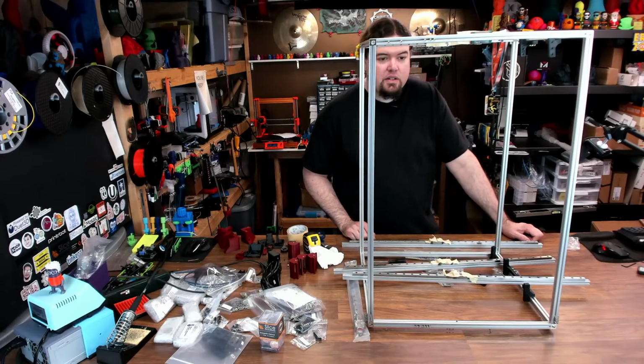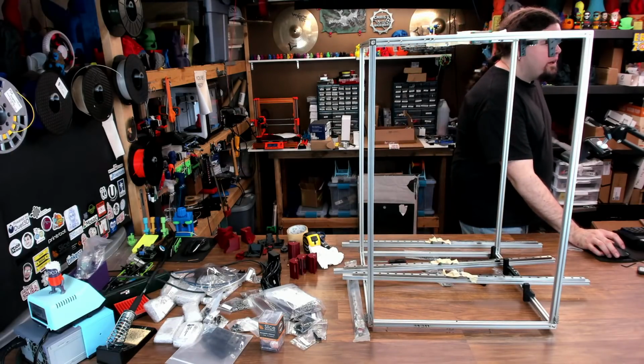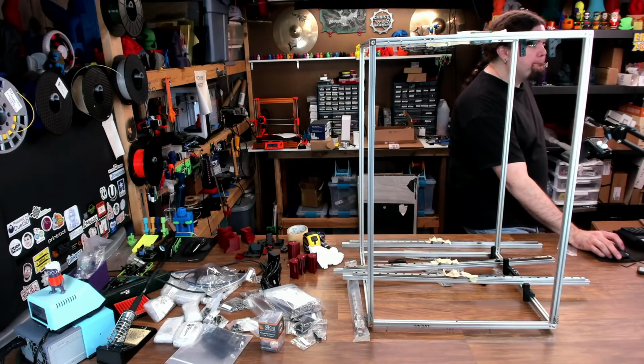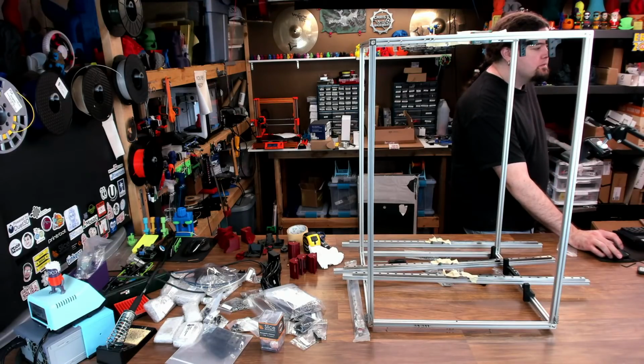100% fill, 0 spacing. Okay, what we got now? Attach linear rails from the Z to the extrusion. We did that. 8 per, evenly spaced, loosely placed, 1 per bolt. Yep. Number of holes, bolts will vary. Now you can slide them through nuts in the channel. Don't make it tight yet. We'll adjust it later.